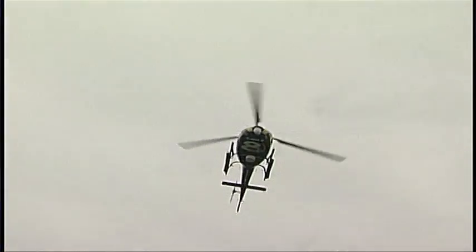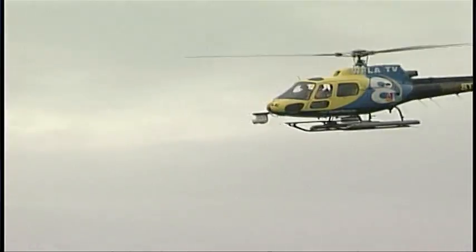The equipment that's in the vest, the survival gear that's in the helmet bag, the first aid kit under the back seat are all things that can help you survive in an emergency situation. Make sure that when you leave the aircraft, if the pilot doesn't direct you to do so, look for those items, the green helmet bag in the back seat, the vest that the pilot's wearing. Try to take those with you, because all those items can be utilized for your survival. Hopefully this tape will familiarize you with what we have to do with the aircraft, both operationally and safety-wise.